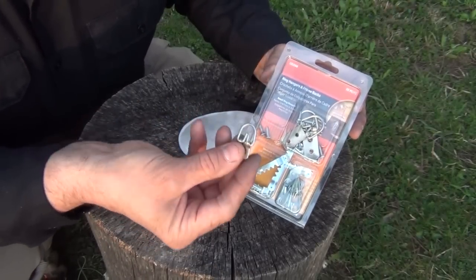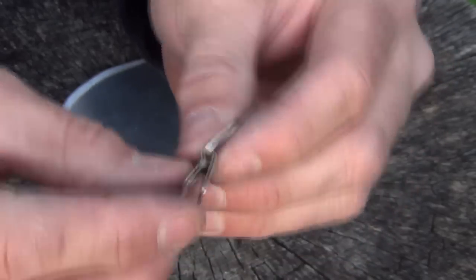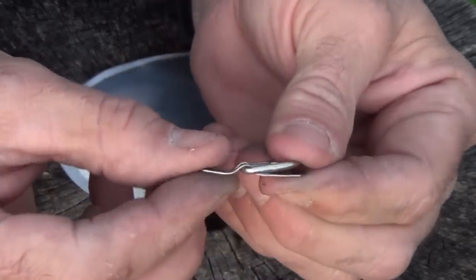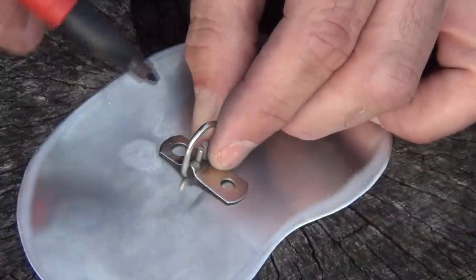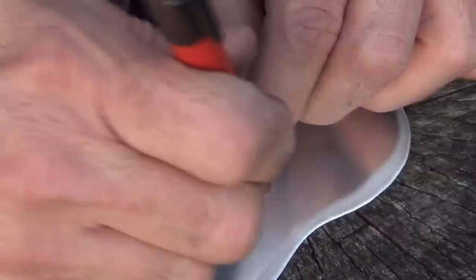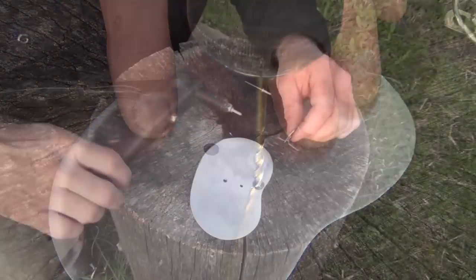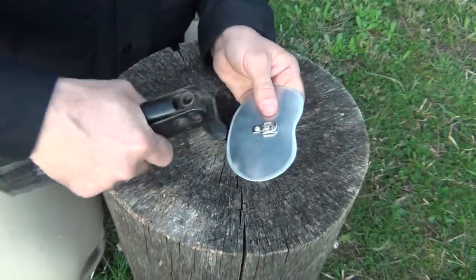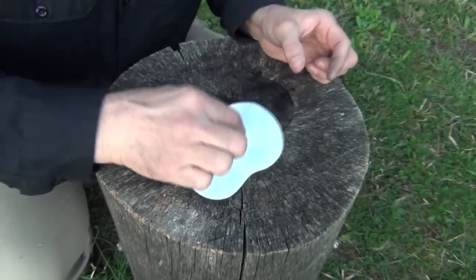Next we get one of these small picture-hanging loops, just from a ring hanger set. This is a piece of metal that's folded, and I've already opened it up. Go ahead and open this up the rest of the way — just like that. You can see we've got a bit of a bump there. This is going to be our handle. We find the approximate center of where we want to raise and lower our lid, make a couple of marks, and then drill two holes — these are 1/8 inch. Next we take a couple of aluminum pop rivets and fasten it on. And just like that, we have our handle and our lid so we can pick it up off the pot.